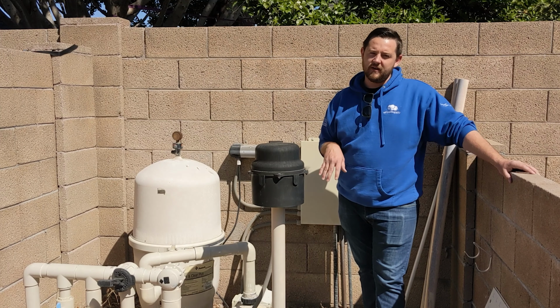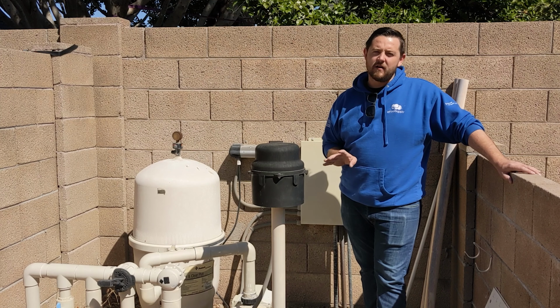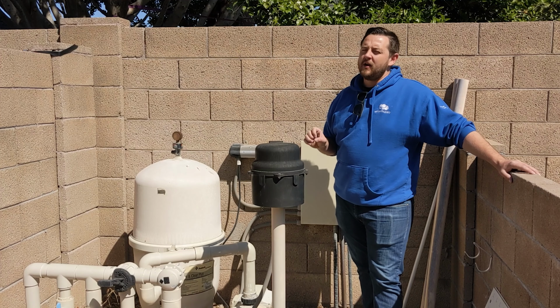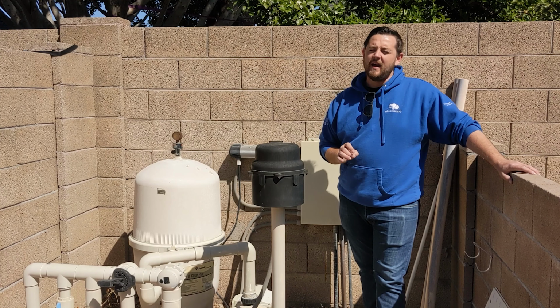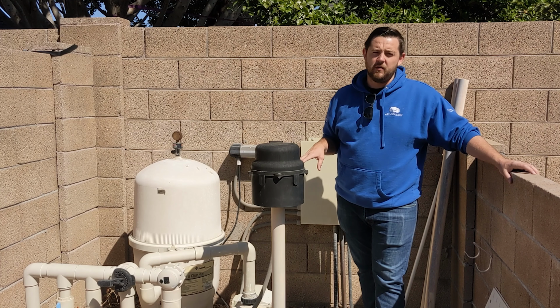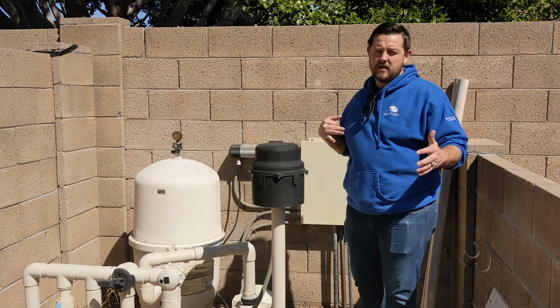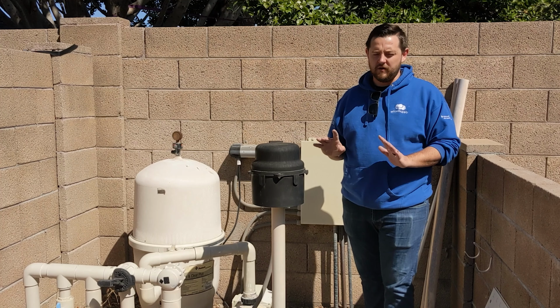So it's very important that you locate this panel, turn everything off, and in some rare occasions, depending on what you're doing, go ahead, walk over to the power panel at your actual house and turn off the supply to the panel located at your equipment. So then that way you're not taking any chance of any equipment getting any power during any process.